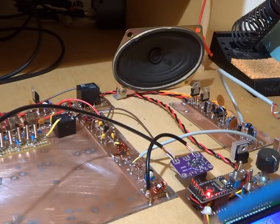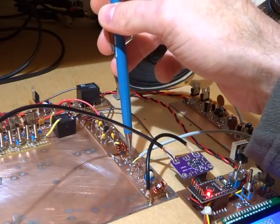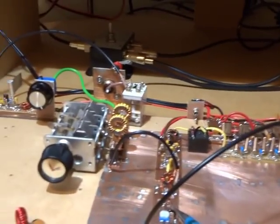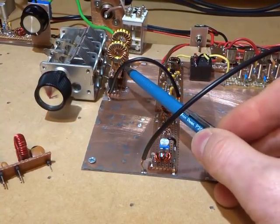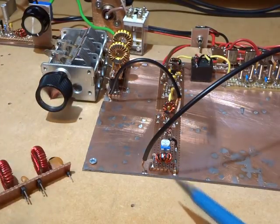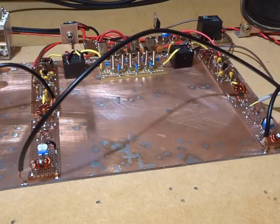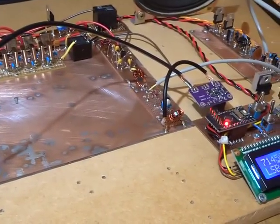Voice, of course, will just feed straight in, so the output of that product detector will feed audio into there, and then run the whole thing backwards, and we'll produce out the back end of that mixer our desired frequency. And what we'll probably do is feed it back through that bandpass filter before going through the power amplifier chain, just to get rid of any harmonics. So I think that'll be the thinking for converting this into a transmitter. But anyway, as a superhet, it is what it is. It's a very simple radio, but it's a very achievable radio.